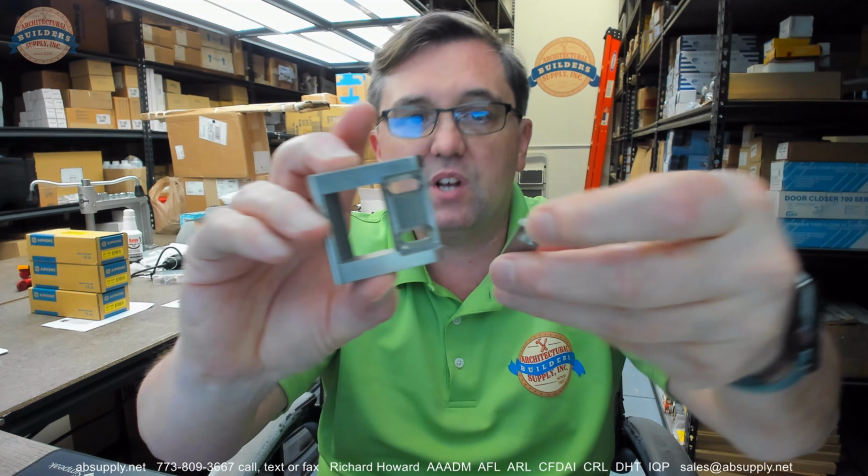In this video, I want to bring you a closer look at the Kawneer number 133588. This is a strike used for the 1786 series exit devices for both a single door application, and it can also be used in the mullion application. The part number for the common mullion is the 133587. When you purchase the strike, you're going to get the strike portion, and it all weighs about 0.28 pound.